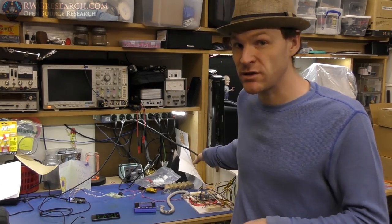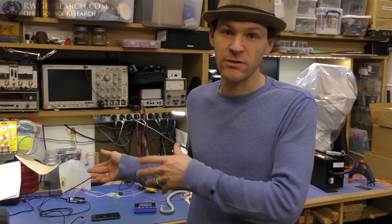And what I added with the little circuit board a while back, the little bitty one, is an active balancer. That's all it does. So the new BMS system monitors all the voltages, and tells me if I'm overcharging something, undercharging, over-discharging, or if the cells are out of balance. It gives me all that data, packs it into a serial bus, and then I can access it from the outside. That's really what I wanted it for, and that's what I'm using it for. I bought it to save myself a lot of effort and time from engineering something from scratch. So anyway, let's go ahead and get started, and then we'll come back here and talk about some more stuff.